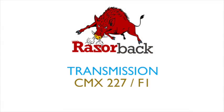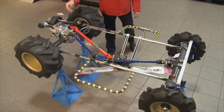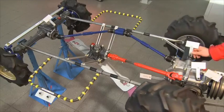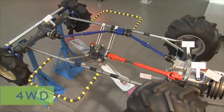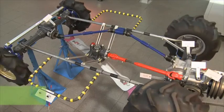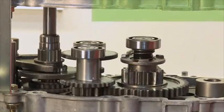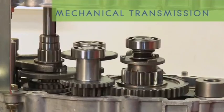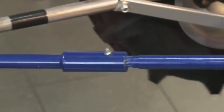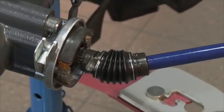The Razorback has a mechanically based dual range four wheel drive system that is coupled to an infinitely variable hydrostatic transmission. The mower can also be driven in two wheel drive. The mechanical drive train resembles a Land Cruiser or Patrol, with drive shafts from the gearbox to the centre of the mower with universal joints through to the front axle.